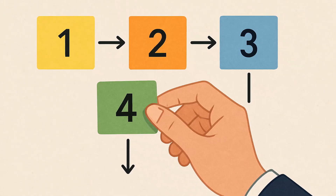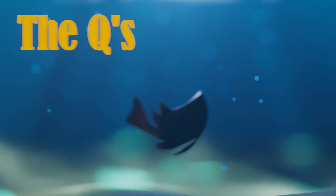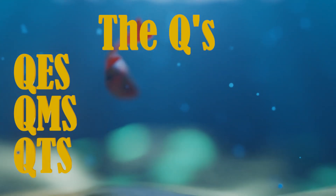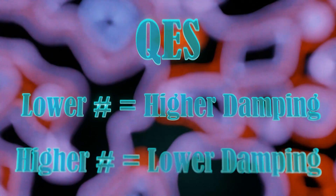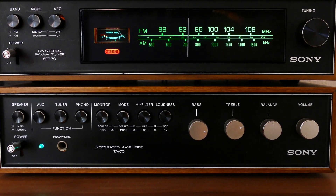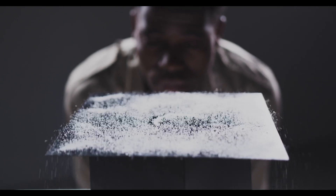Now I'm changing up the order of my video, as I want to talk about the DATS graph in better detail. We've all seen this graph, and graphs are boring — they remind us of the horrors that were math class. However, this graph is different. It tells a whole story about the speaker and how it's best utilized. First up, the Qs: QES, QMS, and QTS. QES is how well damped the electrical system is, or essentially the motor. A lower number is more damped and a higher number is less damped, and damping is a dissipation of energy over time. So the lower the number, the quicker the energy dissipates from the system, which means there is a sweet spot in the middle for speakers, as they need to vibrate without losing energy instantly — but they can't vibrate forever either.